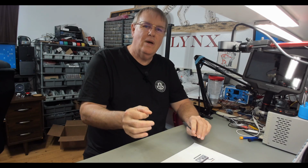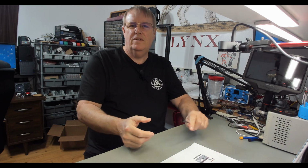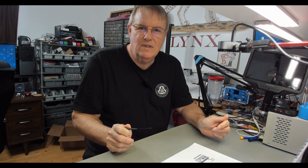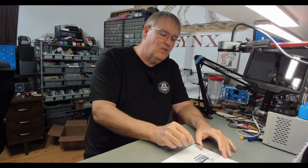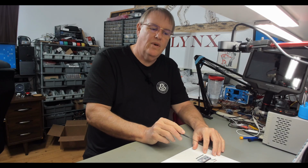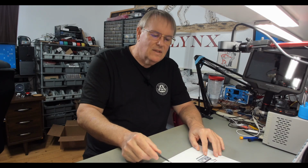And now imagine that was with me putting like 16 watts out of the radio. If I'd have been putting 100 watts out, or if I'd had an amp and putting out 600 watts, imagine the increase we're talking about, the differences there would be. So a good match with the radio with your antenna tuner is very, very important. This does not mean that antenna tuners are not good devices and they're not needed.